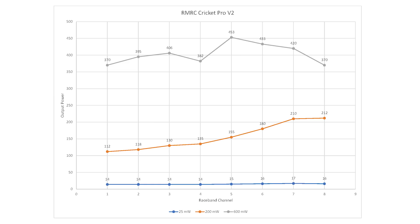We have to take these results with a grain of salt. A little while back I tested the AKK Ultimate video transmitter using a different tool, the results were all over the board, and I had to conclude the tool wasn't accurate — I deleted the video and released a retraction. These results are only as accurate as the ImmersionRC RF power meter, which is certainly not as accurate as a $3,000 power meter, but it's been calibrated for this exact purpose. And it is interesting that we see 112 mW on Race Band 1 instead of 200, and we never really see it get close to 600 mW.